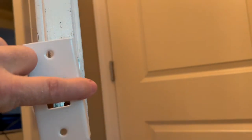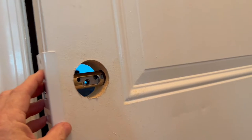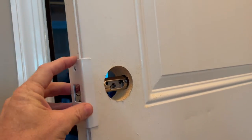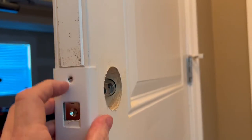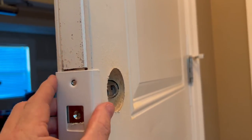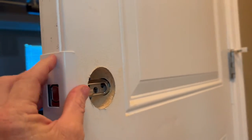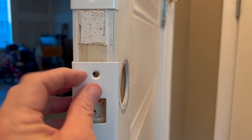One of the elements of this kit is the latch guard that goes over the outside of the door, and that adds to the thickness of the door. When you have the strike plate in there, those two can easily rub — that takes up a lot of space. I'll mark it here and there, then I'll remove this with the router a sixteenth of an inch. I mortise this one so that it's a sixteenth of an inch in from this edge, so that when this is in, it's flush with the side of the door. That's another trick that'll help you get these things in.